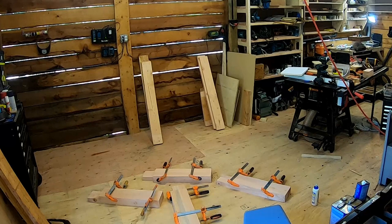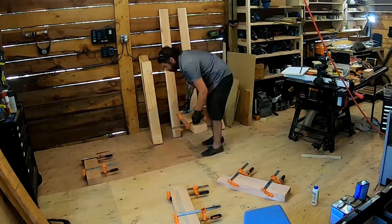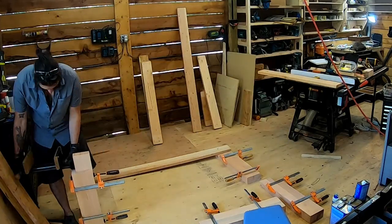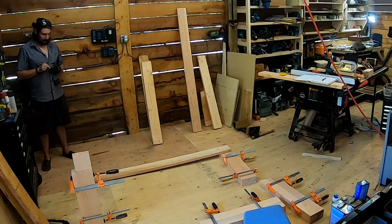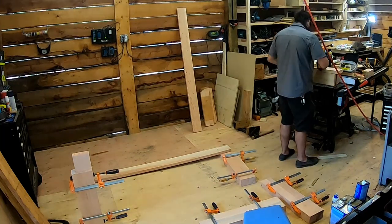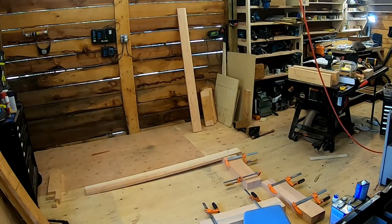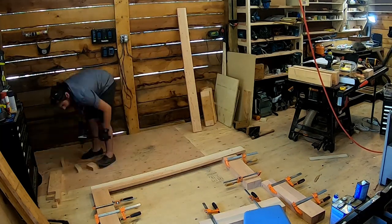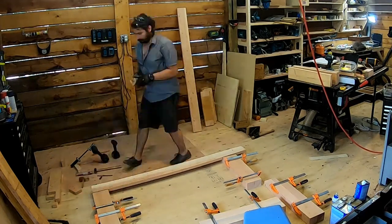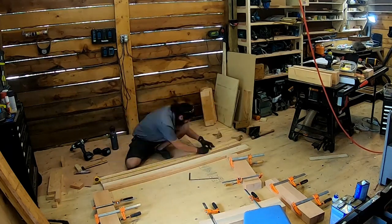I'm basically breaking every rule of bench construction in this project because I want to have a lip around the whole thing so I can clamp stuff along the edge instead of clamping everything to the face, which is common on workbenches. Also it's common to make a really thick laminated top — I do not have the wood for that, so I basically gathered up every bit of scrap I could find and put it together like a big Tetris so I at least had some density to hammer against. The last thing that's different is I put the vice on the tail on the opposite side, and I'll explain why when we get to that section.